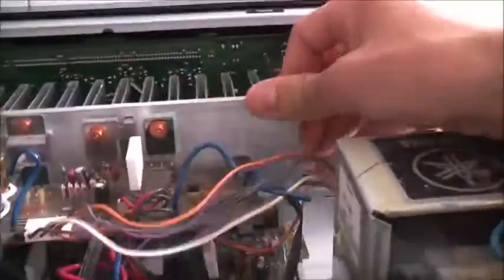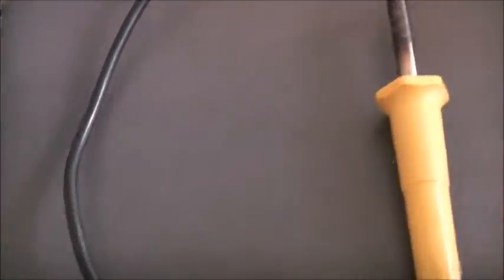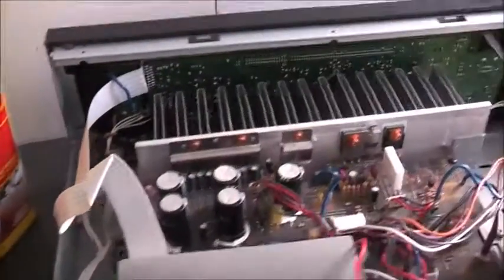Upon replacing this transistor, I've got to put a new jumper — a new bit of wire on the circuit board to retrace it, because the circuit board traces are pretty small on that. I really need a good soldering iron for something that small. My Hakko one's put away in storage, but even that's not good because it's not adjustable. I need a proper soldering station with adjustable temperature.